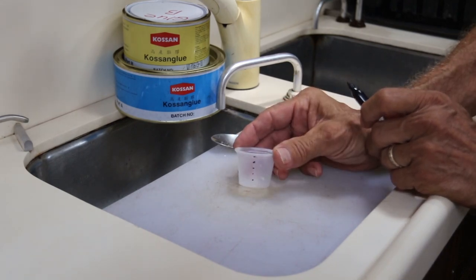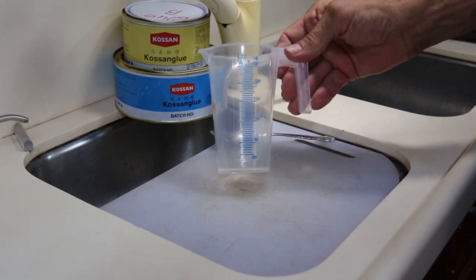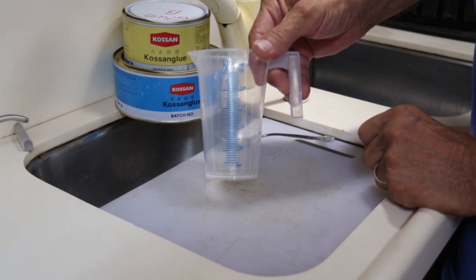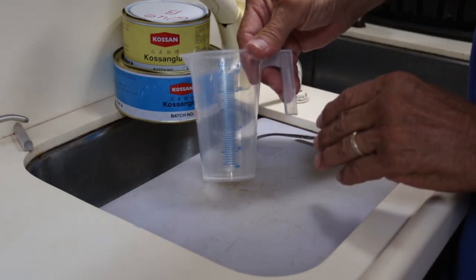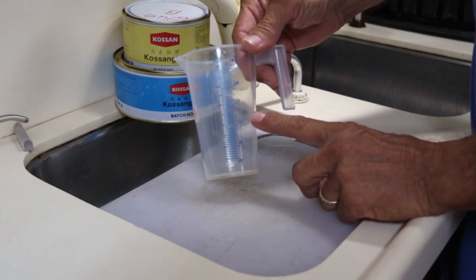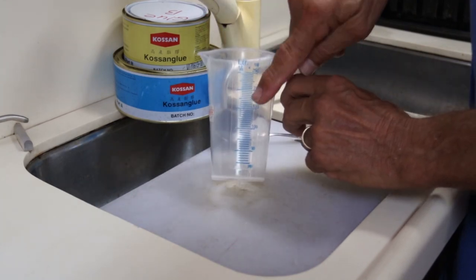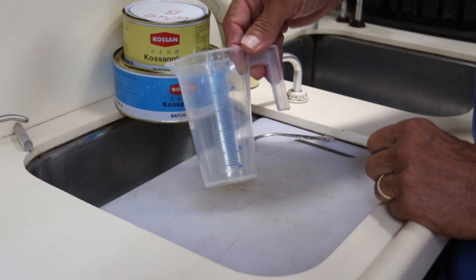Normally I would make about six, seven, eight cups at a time so I have plenty and don't have to go through this whole measuring process every time I go to mix glue. The next way we started mixing glue was with a metered cup. A cruising friend gave me one much smaller than this, and I used it for several years. It was a type of plastic I could wipe out with acetone to clean out the glue, and even after it hardened up I could squeeze the sides and break it out. But I could never find a replacement when I finally had to throw it away. This measured cup is in liters — I got it at a local hardware store in Malaysia. It's good for measuring paint once or twice, but if you try to clean the insides with acetone it'll discolor. It frosts the inside, so you can't see your marks from the inside, nor can you see your liquid from the outside. So it's a very limited-use item.